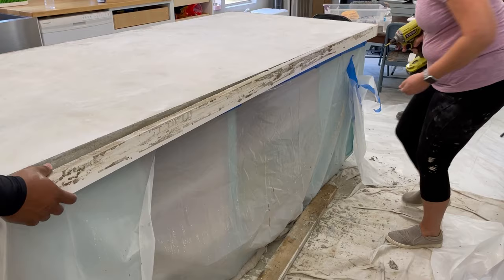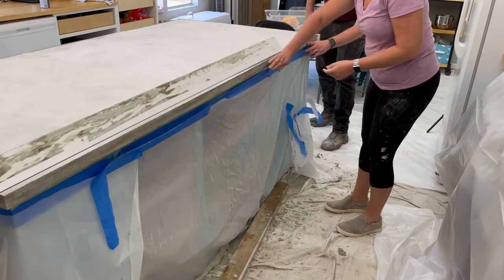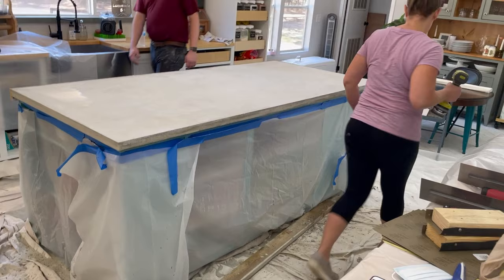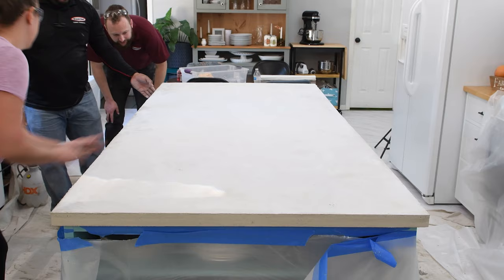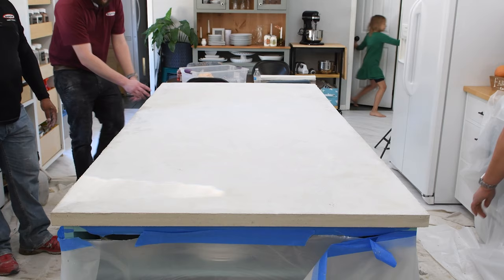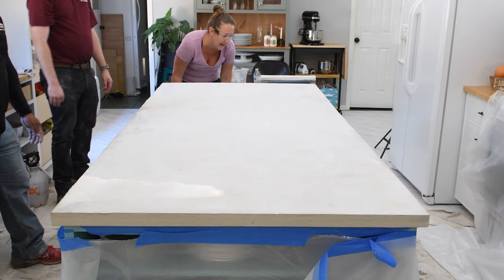After the long hour of waiting, it was finally time to start removing the forms — nervous but super exciting. I started by taking out all the screws, but learned I didn't really need to remove the screws on the sides themselves. Once you release the screws from the cement board from underneath, the sides just pop off — which was good because those side screw holes were filled with cement, making removal nearly impossible otherwise. Remove all the screws around the bottom, then carefully pop the edge off. With the WD-40 applied earlier, the forms really did just pop right off.